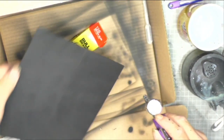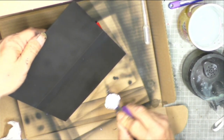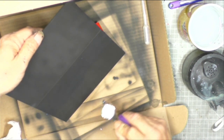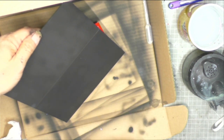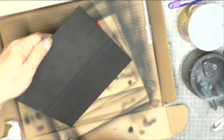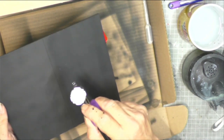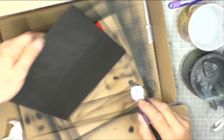Okay, as you can see, it has changed the colour a little bit. Varnish will do that, it will make it slightly darker. I'm calling this the equivalent of 2 layers, and the important thing about varnish is you do want to let it sit overnight, let it really harden. One of the things I don't like about varnish is it's really hard to tell when it's dry.